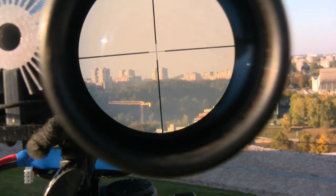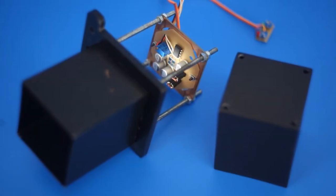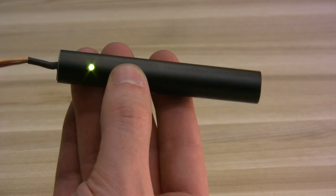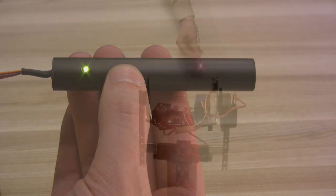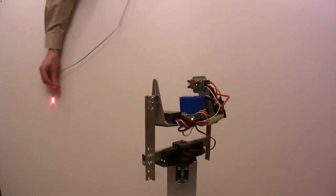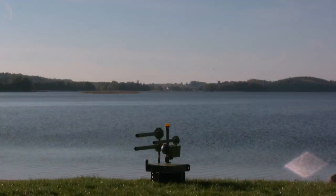The optical sight allows the beam to be sent directly to the drone. An optical receiver is installed on board the drone. The receiver includes a focusing lens and an array of sensors. If the radio link is broken, the optical receiver rotates until it detects the communication signal, afterwards maintaining correct orientation to receive the signal automatically.